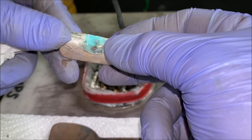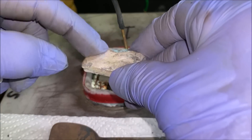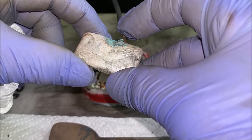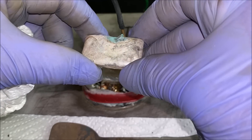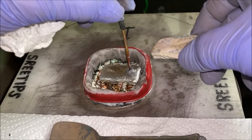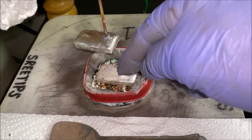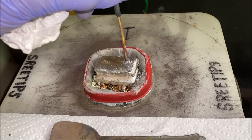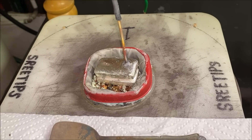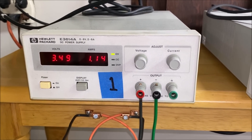What these are — there's a piece of copper in there, and when I made this anode electrode bar I melted the piece of copper that was going down in there, so it just became scrap. We'll use this as a buffer so the electrolyte does not come in contact with our good anode electrode bar. We'll set our anode electrode bar right on top of that sacrificial bar, and you can see the current flow is good.